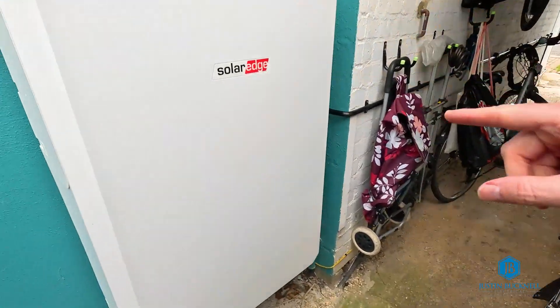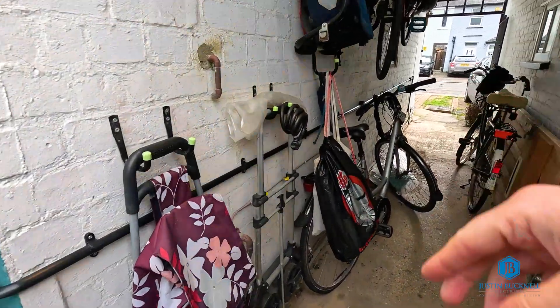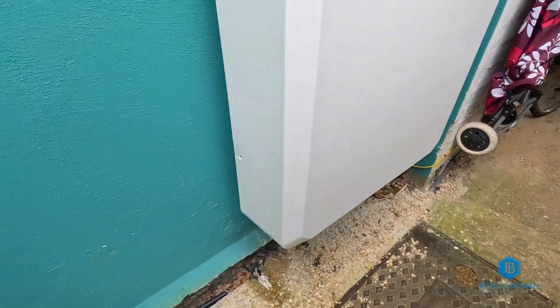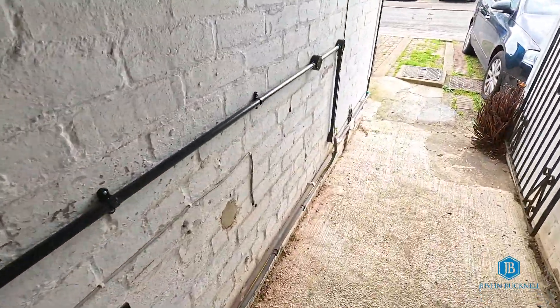The installation is now complete. The SolarEdge battery is fitted, installed, up and running, and it's all shown up on the customer's app. He's been able to set the battery to charge and discharge at certain times of day to suit his requirements. Walking through the completed installation: the battery is up on the wall, fed from the inverter inside on the other side of the wall, with DC cables routed through the conduit. The bonding conductor connects into the terminals on the lower inside of the battery. Nice little job adding a battery to an existing solar PV system with an existing SolarEdge inverter - it made adding the SolarEdge battery much easier. Thank you for watching - please like and subscribe.